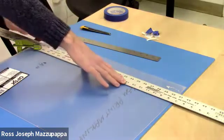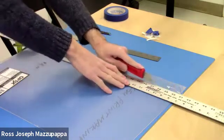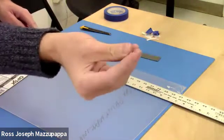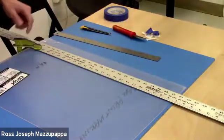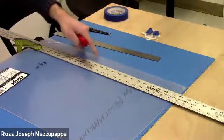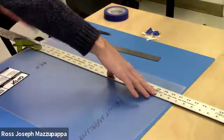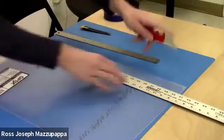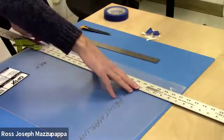And so I'm not actually going to try and cut through the plexiglass. I'm trying to score about halfway down through there. So as you folks can see, I am pulling up a bunch of plastic. I know that's such a great sound too. Okay, so that should be pretty good. Well, actually, as you folks see, my tear here is pretty small. I do want to cut a little bit deeper on small edges. If this was a much bigger piece of plexiglass, and say I had a hole like 6 or 7 inches, I'm busting off the other end here. You can go a little shallower, but just make sure you have a really nice, precise break.